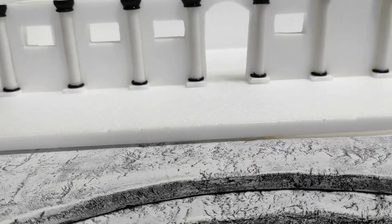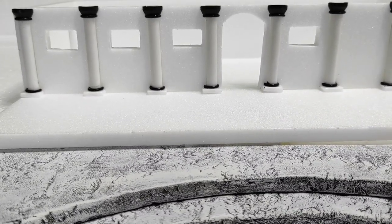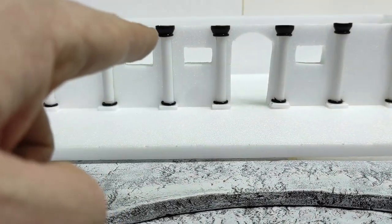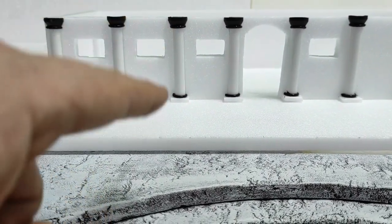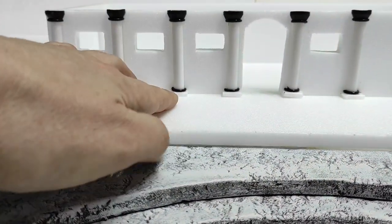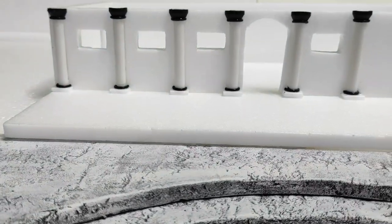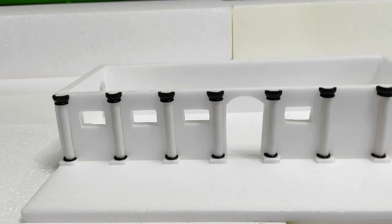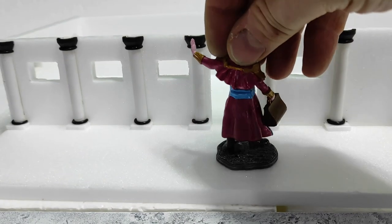So the half columns there with PVC, half PVC pipe having a diameter of 0.8 centimeters, so 8 millimeters, and then two kinds of gaskets for the top, and the same gaskets I used there in the bottom, repeated there. Cut in half with a support of 3 millimeters, 1.5 centimeters by 0.8 centimeters in depth, and overall it is 6.3 centimeters from here to there. It is 6.3 centimeters. Let me check with J there.